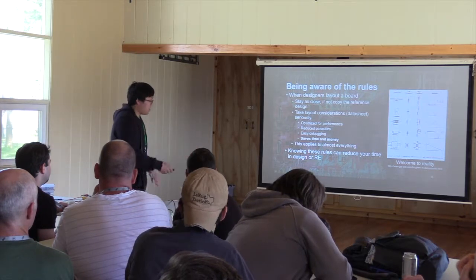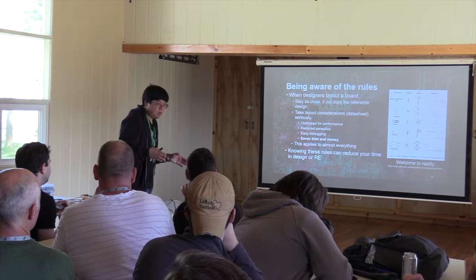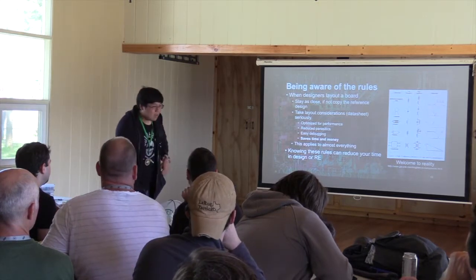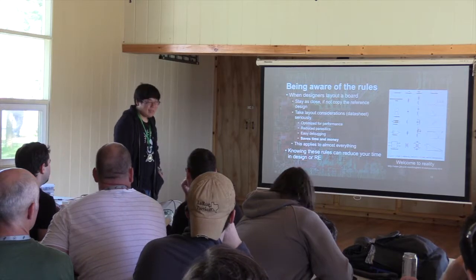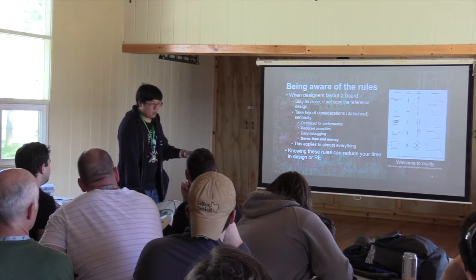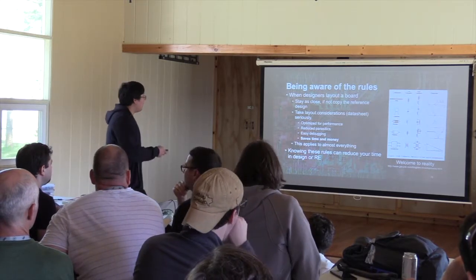One thing they try to do is slow down the edges on those digital signals so that you don't get spurious RF signals, because the FCC doesn't like that, or so that other traces on your board don't pick that up as crosstalk or other various things.